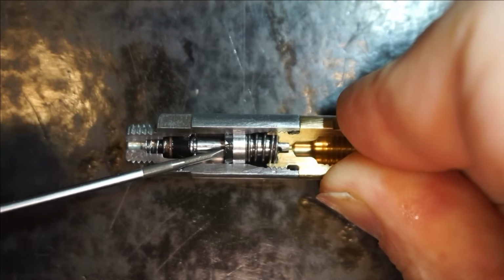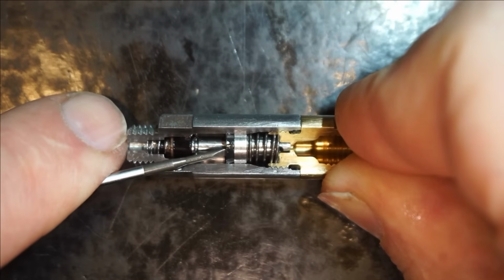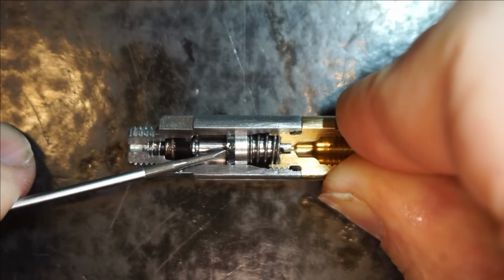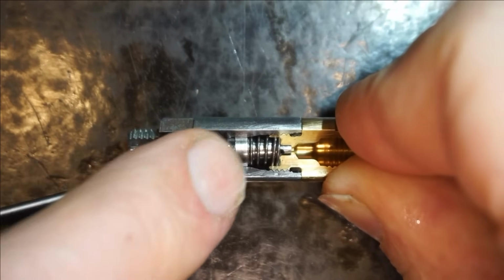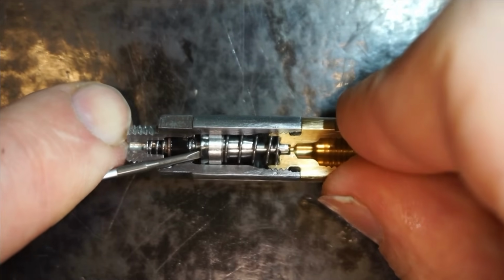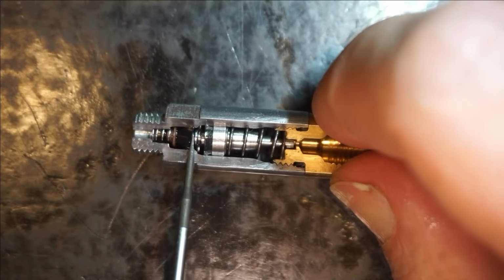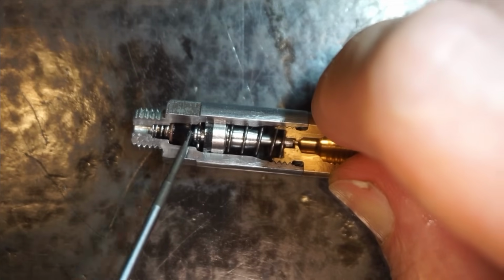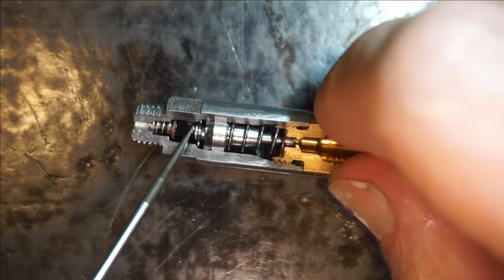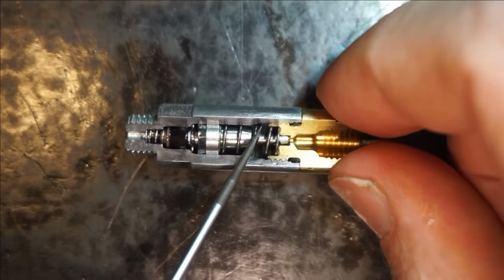And even if we increase the pressure to this piston distributor, it will continue to stay in somewhat of a hydraulic lock until we let go of the pump and pressure on the intake of the piston distributor falls. Then what happens next is that this return spring forces the plunger piston back into its initial position, and thereby oil from this lower chamber pushes the check valve piston back into its seat and thereby opens this intake hole on the transfer tube as a passage for oil from that chamber to move to the transfer tube, to the cross hole and into the upper chamber.